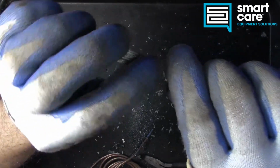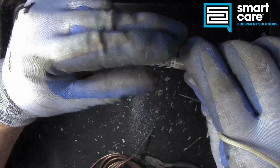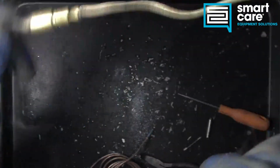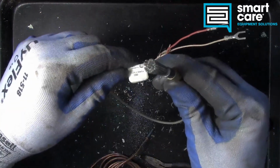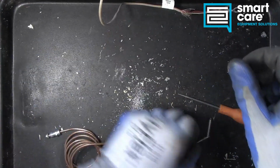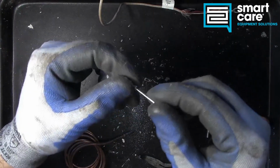And there's also a fine white powder in here that takes up airspace, makes it possible for heat to transfer through into each individual thermocouple. So that's how we get a significantly higher DC voltage output from a Thermopile than we do from our thermocouple. We've stacked all of the thermocouples up to create the Thermopile.